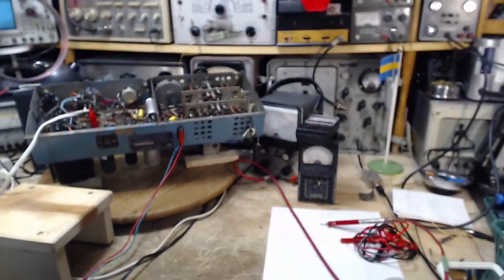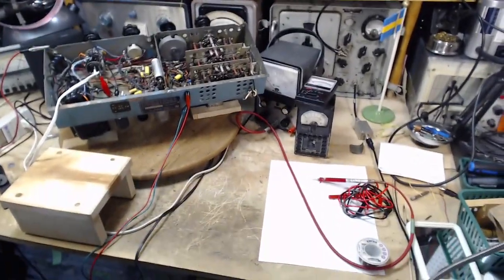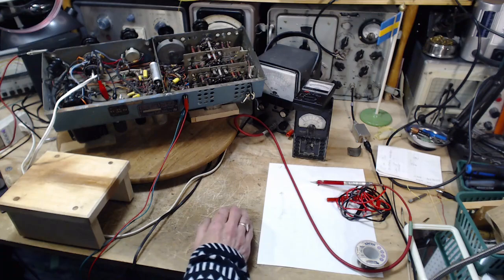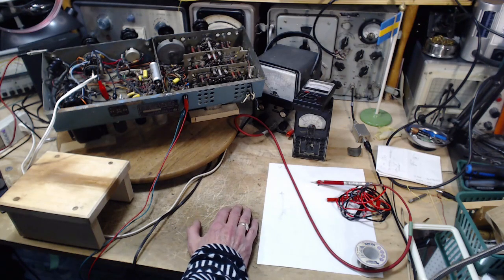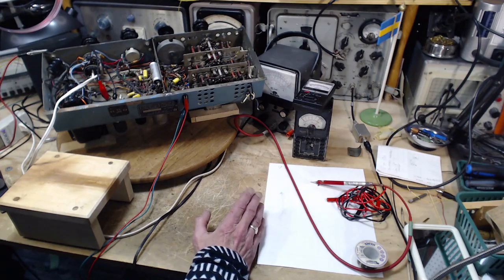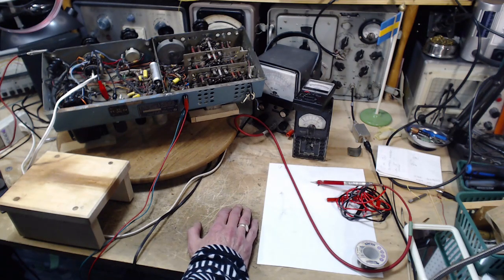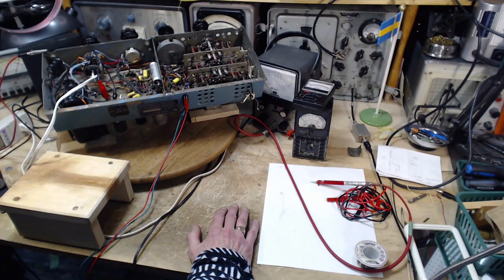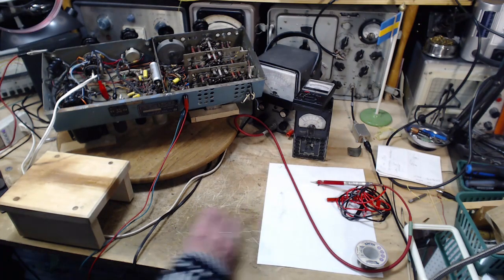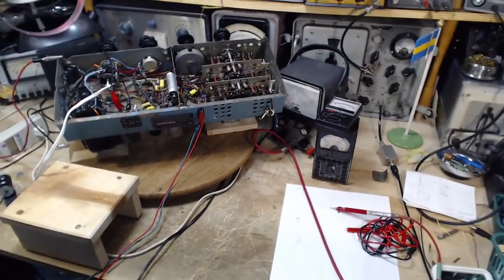This was a big problem from when it was discovered, right when streetcars started operating, that would be the very late 1800s. Up until about the 1940s or 50s, corrosion caused by stray current on transit systems was a going concern. Many of the big cities in North America abandoned their electric transit systems, and it got down to just a few cities, Toronto being one of them. Now more electric systems are being installed again, and I think they still run on direct current. They'd still have all the same problems, but hopefully smarter engineers today are designing things right from the start. So you know, when you see those guys digging up that water main, you wonder what happened to it. If it's in the city of Toronto, chances are the subway system killed it.